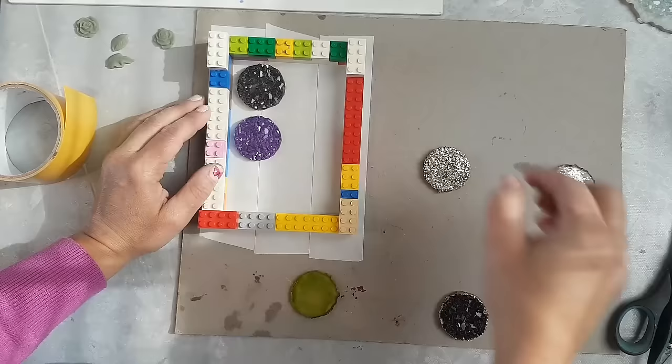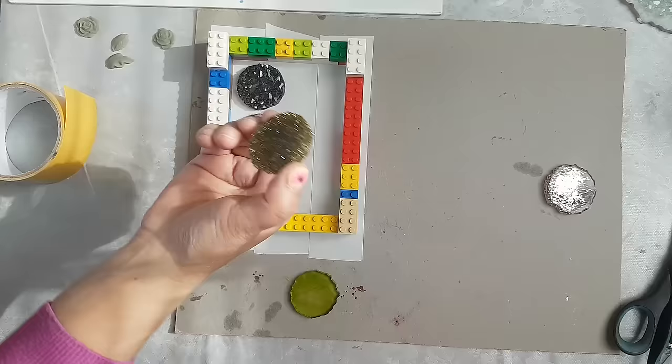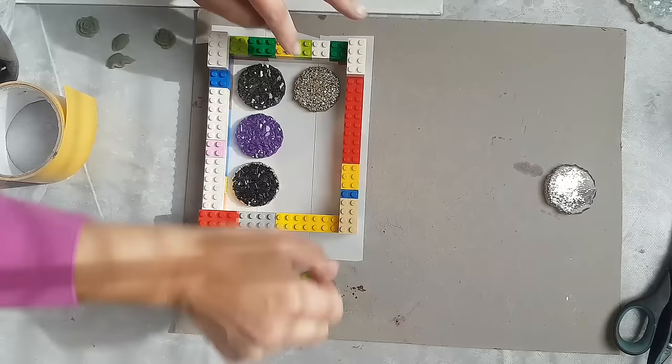But do make sure that there is a space in between each object, and you can be frugal with the space around the edges and around each master, but do leave at least a finger width depth along each side, and this will create a nice sturdy mold that will last.